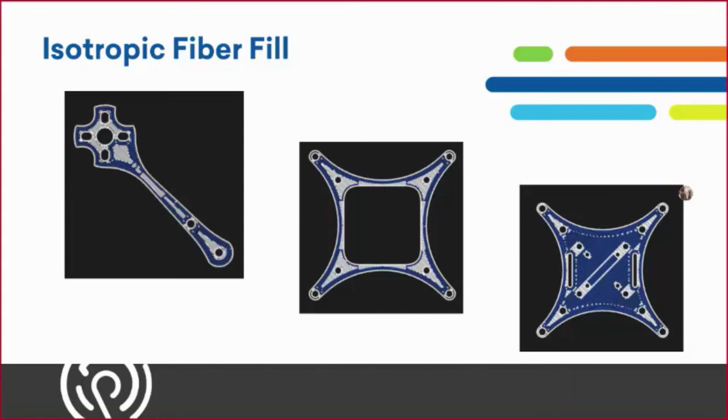As you can see, the way the fiber was run is represented in the blue lines, and we also use the isotropic infill as well. And that infill will then turn those fiber runs to make sure that we have as much strength as possible, rigidity as well. That fiber was only run on the 3rd and 4th layer, and then also the 5th and 6th layer on the bottom. So that wasn't just a smaller plate, so we just need a little bit of stiffness for that.